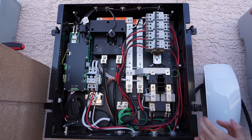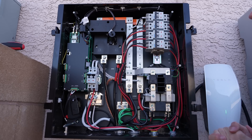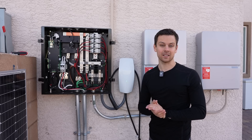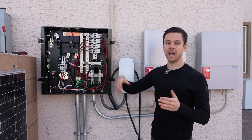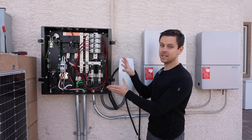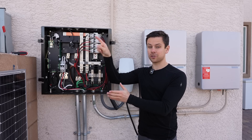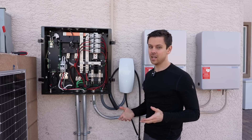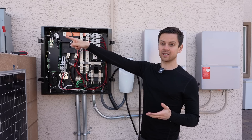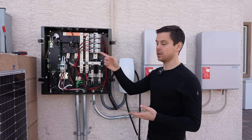I didn't recognize anything in here, so I asked if they were making it themselves — and they make this in-house. They designed and built it from the ground up. The grid-tie inverters are monitored and controlled by the gateway, but they don't have to be connected there. In this system we have an 18K that's connected to the load center, not the gateway. When it detects that it's exporting, it will automatically charge the batteries — you can have 10 grid-tie inverters over there and it will still push that power to the battery at the recommended charge rate.